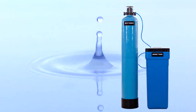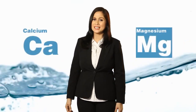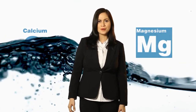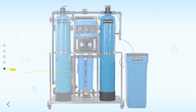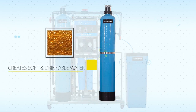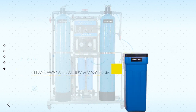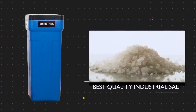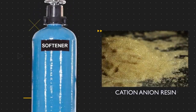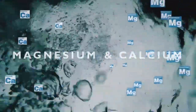To make any source water drinkable, our BlueWaters UniSystems also comes with a water softener and a brine tank. Most waters have calcium and magnesium that make it unpleasant and heavy to drink. The BlueWaters UniSystems takes away these elements through the softener tank with cation anion resin to create soft and drinkable water. The brine tank helps to regenerate the softener by cleaning away all calcium and magnesium. The best quality industrial salt used in our brine tank effectively makes the cation anion resin last longer because it will flush out all the magnesium and calcium through the regeneration process.